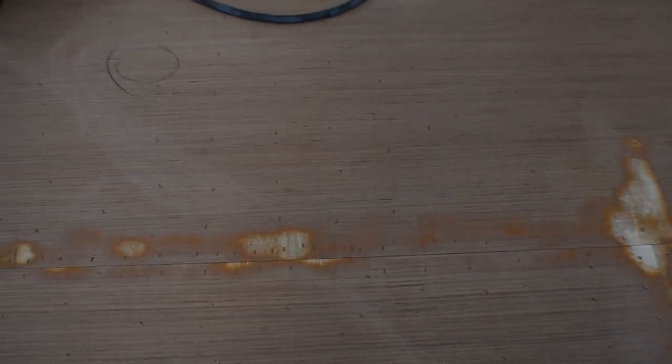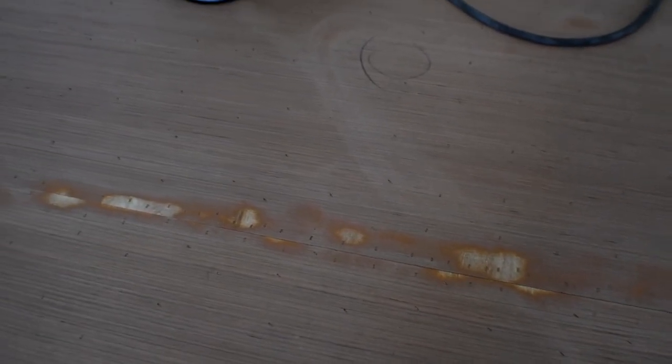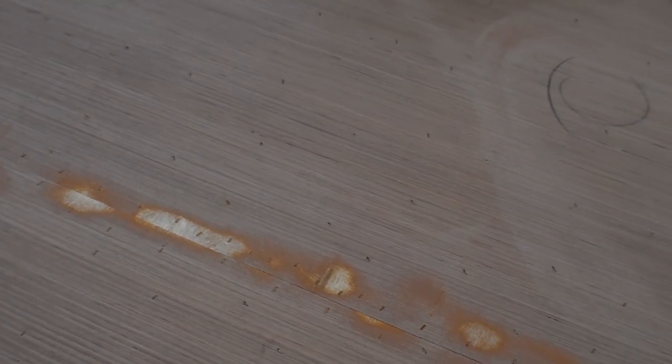This seam right here — you can see that corner was obviously a little bit high and it got sanded down. This is what you're going to want to look for whenever you're doing your seams. This is what it's going to look like when you're done sanding. Now this seam is completely ready. Look right there — there is a little bit of a spot on one board that was raised up; however, back here it was pretty much level. You can tell what side was raised up and what side was not by looking at what side the sanding is taking place on.